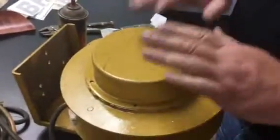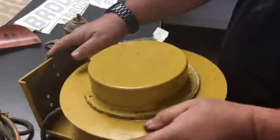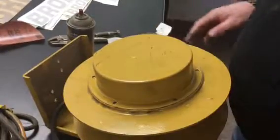Once all your brushes are clean and the contact rings are clean, we're done. Reinstall this cover and test the crane. At this point the crane should work — you should be able to roll the reel and the crane would work with your wires. This should fix the problem. If it does not fix the problem, email me back and we'll go on to the next step.